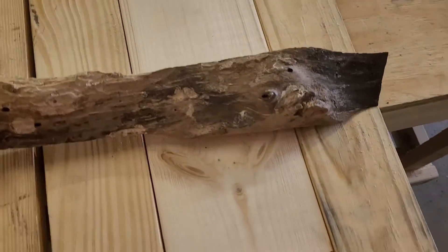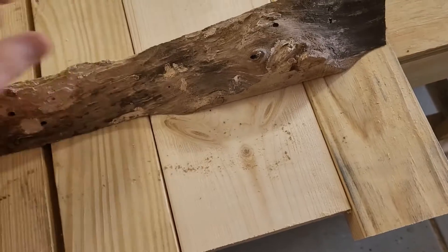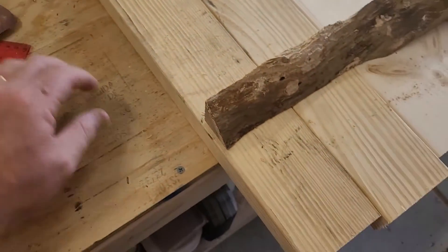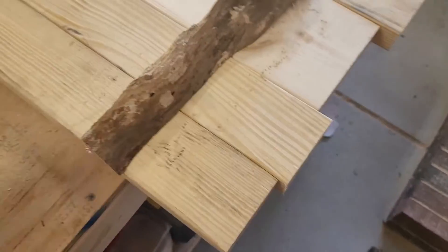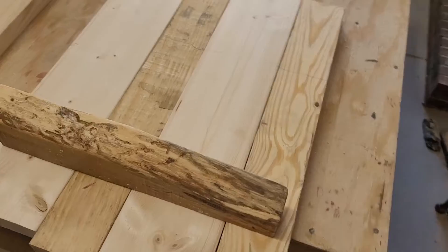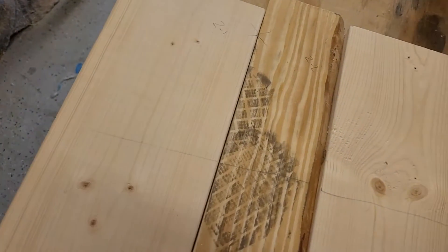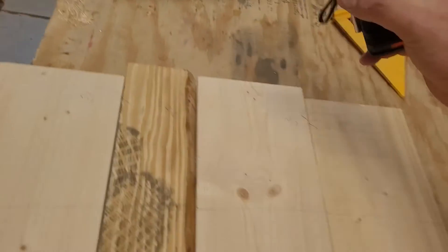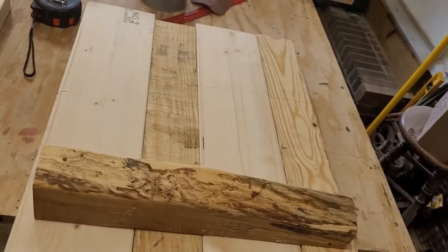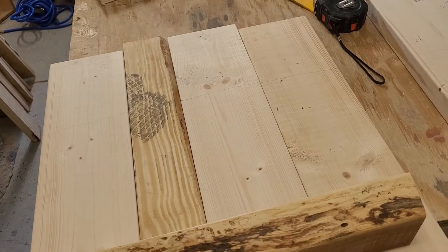This little guy here is a little bit more rustic. These will serve as shelves, and I'm going to put key ring hooks on the bottom of them. These are all roughly about 24 inches tall — that one is 16 right now, these two are roughly about 20 inches, and that one there is about 18 inches. Entryway key holder — I'll do some keyhole slots in the back, put them at 16 inches on center so you can put some screws into your studs.